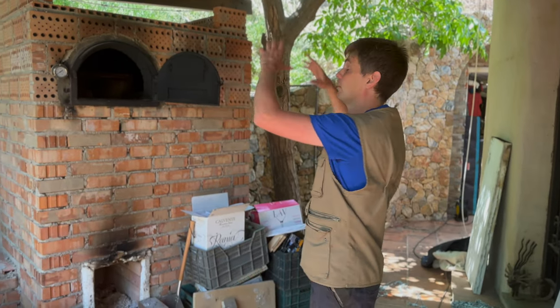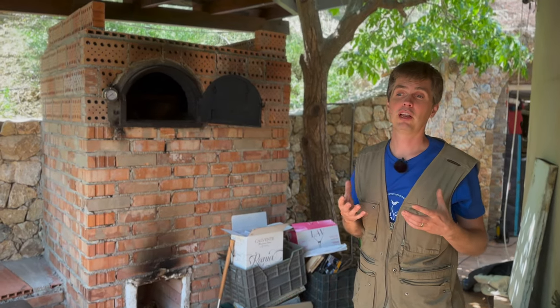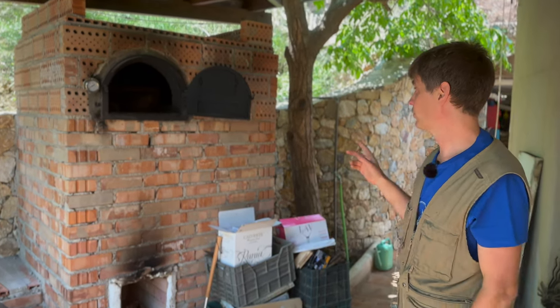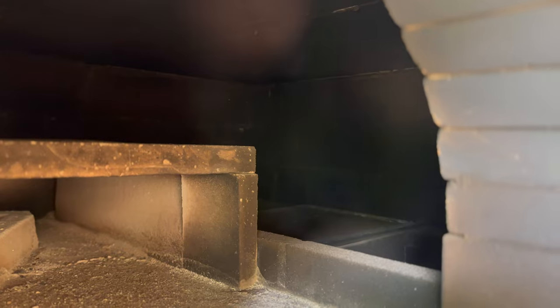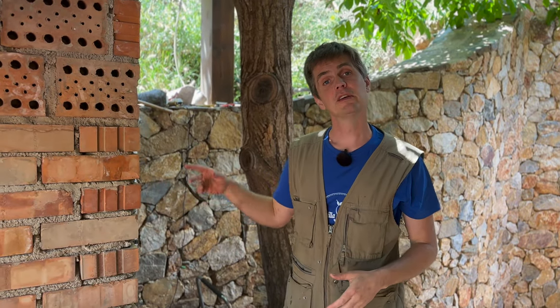Once the gases get into the oven and start to lose heat to the oven's mass, you're not dealing with 800 degrees anymore — you're dealing with 300-400 degrees. At that point the metal gets hot but it's not a huge risk. We built some little baffle plates — little metal plates that switch over. You can move this to shut off the heat exchanger in favour of a bypass so if we've got enough hot water we don't boil the thing. I left it open the first time we fired it and we maxed out the temperature sensor at 128 degrees with a lot of steam coming out, so it's quite important we can shut that off. Nearly made a serious mistake making these plates — when you heat sheet steel by 400 degrees, it gets bigger. I had to do last-minute adjustments because I suddenly realized this is going to be a centimetre longer when finished firing.